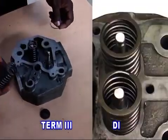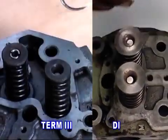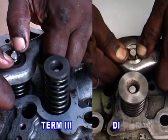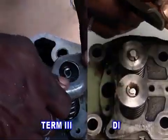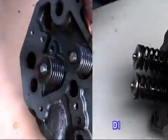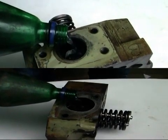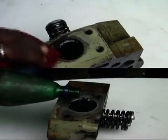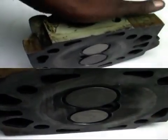Fit the valve spring into the intake and exhaust valves after ensuring the right tension of the spring. Place the valve spring retainer on it and fit the lock retainer to it and apply pressure with the help of a tool. Ensure its secureness by beating the valve using a mallet 2 to 3 times. Make the assembly totally dry by cleaning with cloths and check valve leakage by putting kerosene oil into the inlet and exhaust port or passage of the head.